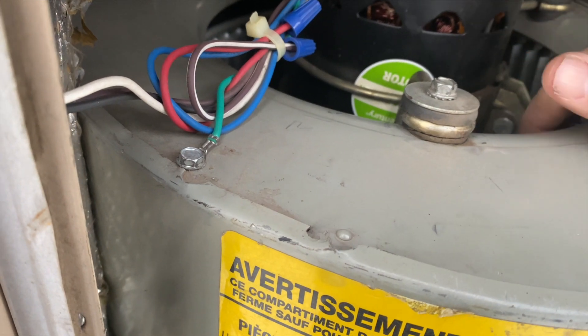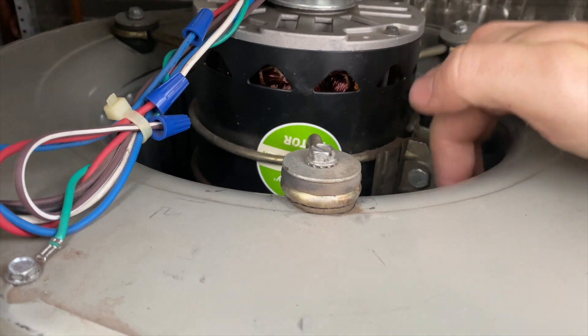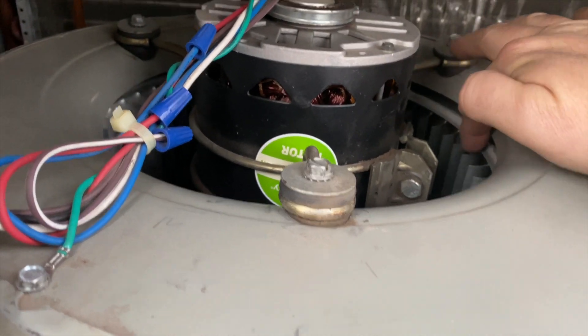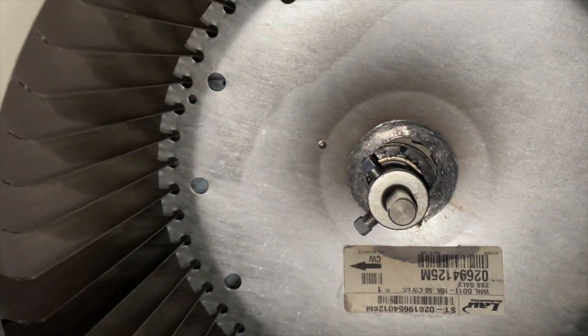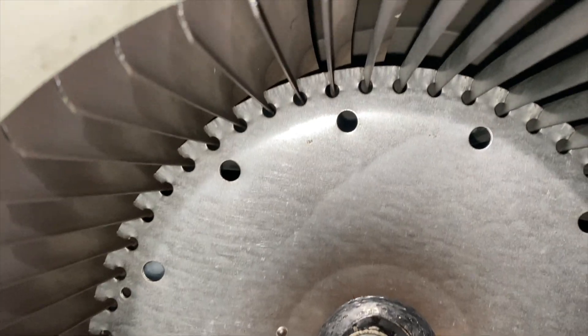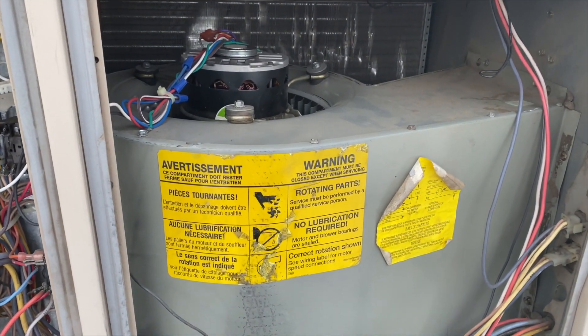It's really hot. The blower wheel hub fell off. We're gonna put the camera under and see if it broke off. I'm really hoping it just slipped off. Well, total bummer — looks like the hub broke off the wheel, so we're gonna have to change out the whole wheel.